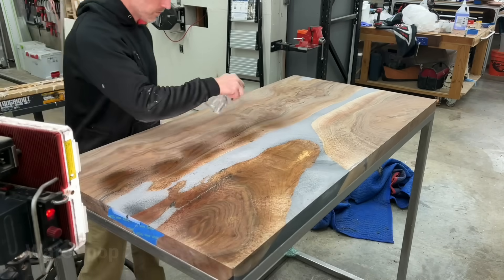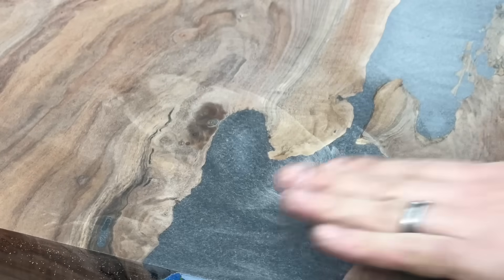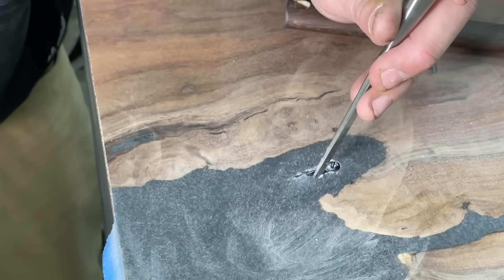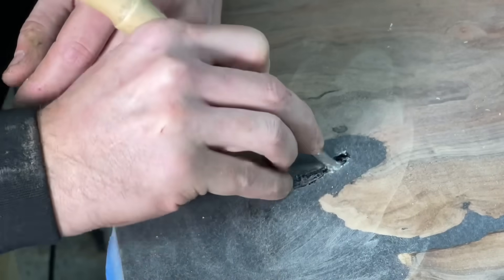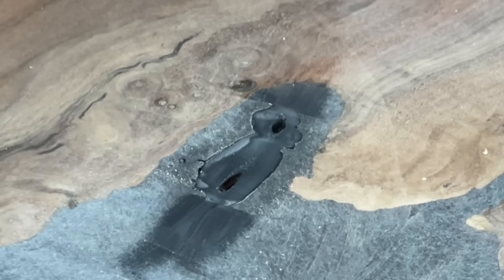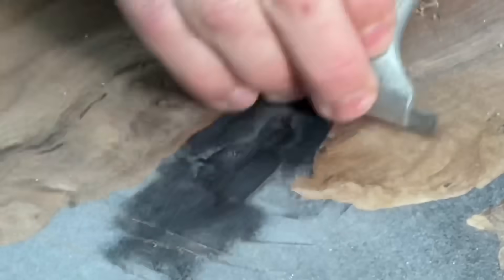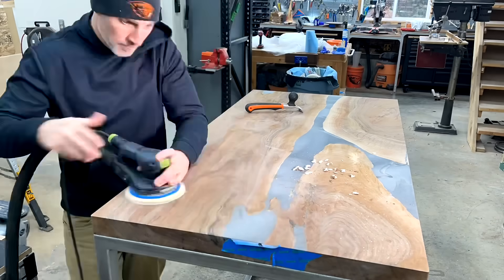I have a full step-by-step finishing blog and video in the description covering every sandpaper grit and why I spray water on it. But before I could get to that, I found a mistake. I never pour my tables upside down — I always tell people don't do it — and I did have a good reason for it. One reason I hate pouring upside down is you get air pockets where the epoxy can't flow up into them, and you don't realize it until you start sanding finer and finer and see that transparent halo through the epoxy. I wasn't able to move on until the next day — had to sand it and scrape it. A scraper is very handy for filling these types of voids.